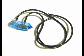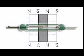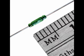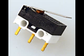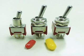Mercury switch contacts are impractical to build in large sizes, so they are typically rated at no more than a few amperes and no more than 120 volts. Another sealed contact type is the magnetic reed switch — a pair of very thin magnetic metal strips or reeds which are brought into contact by applying a strong magnetic field from a permanent magnet moved closer to or further away from the tube by an actuating mechanism. Due to the small size of the reeds, this type is typically rated at lower currents and voltages than average mercury switches. However, reed switches typically handle vibration better than mercury contacts because there is no liquid inside the tube to splash around. A small amount of arcing is actually good for mechanical contacts as it helps to keep them clean from dirt and corrosion. Gold contacts are often used for small currents because gold will not corrode.